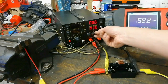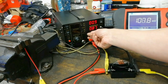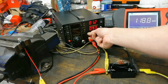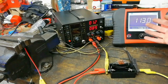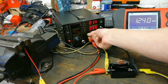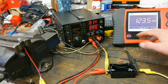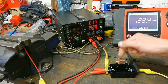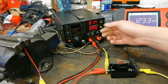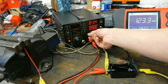We'll bring it up — there's half a volt and the bulb still isn't lit. A wee bit further — there's a volt — and we're up to 116 millivolts. That's well readable on a scope or, as you can see, the number on the meter is a good big number. Whatever value of resistors you have in here will dictate what you read, but this is just over an ohm, about 1.1 ohms. It's not exactly an ohm — resistors have tolerance and change with heat — so it's not super accurate, but it's probably accurate enough.